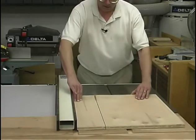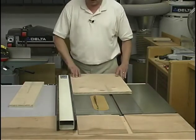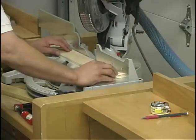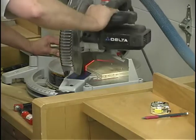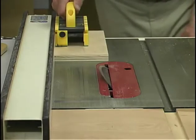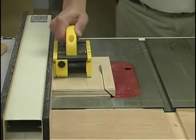Let's dive right in and start construction on our jig. Like most projects, we've started at the table saw by ripping the material to the appropriate width. Then using the compound miter saw, we can cut them to length, and if needed, miter the ends on the various components. Component B needs to be bevel ripped, so we'll set up the table saw by tilting the blade at 45 degrees, set our rip fence to the appropriate width, and take the cut.